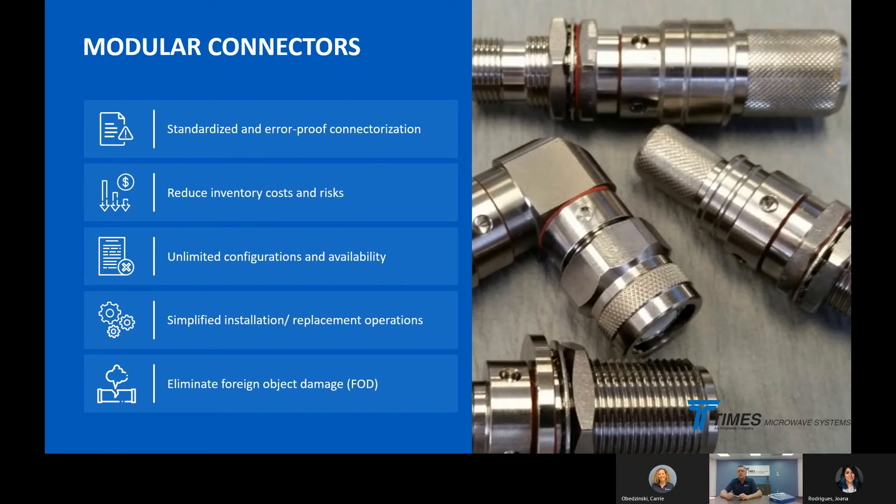The modular connector is almost like a little erector set of building blocks. We create EZ-style cable entries that have all the characteristics of our X-Series connectors — they've got the ribs in the back, the WSB boots, they work with our CST tools, and there's no braid trim. These are bi-metal for excellent corrosion resistance. We have interfaces that thread onto these cable entries, and those interfaces can be used on any cable entry. We also have right-angle joints, so we can build just about any combination you can think of, very economically and very quickly.